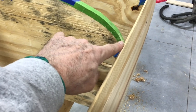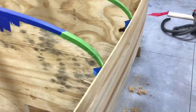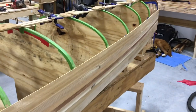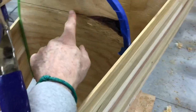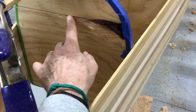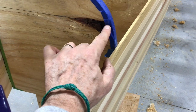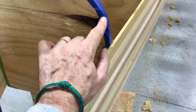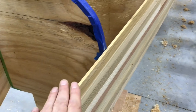So I'm perfect to put a 3/4 inch strip right in there. Now, the only thing about this is that these strips are angling down both aft and forward. So I kind of was curious to see what it might look like. And the fact of the matter is it's going to stick up. This is another line that I drew that's 4 1/4 down, and you can't see with that knot, but it comes over to right about here. Now there's quite a bit of space here, so we're not going to get up to there. We're going to still go ahead and let the strip lay fair, and that's fine. It'll look good because it'll be running smooth and fair.